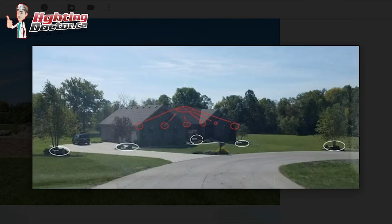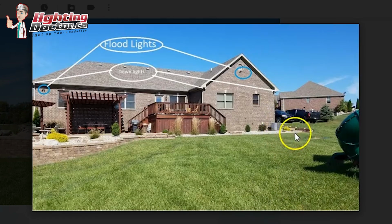And if this walkway keeps going around, then that's maybe where you use a couple more of those path lights. Just keep in mind that 8 to 12 foot spacing. So I think it's pretty easy to do. If you want us to come up with a kit that's got those lights on it and the transformer that you need, I think your runs are all more than safe.